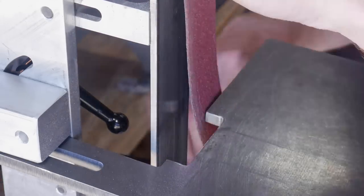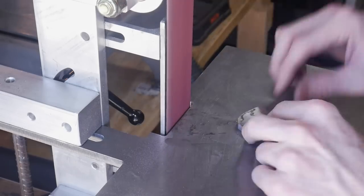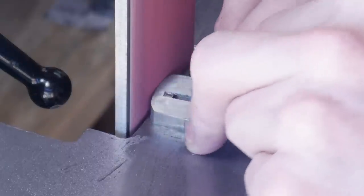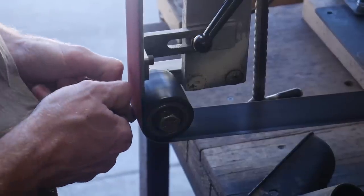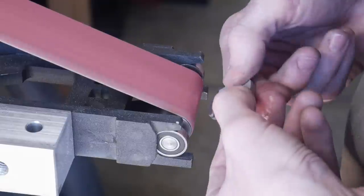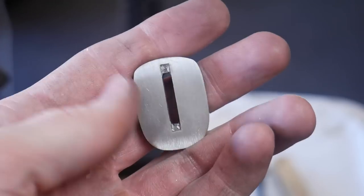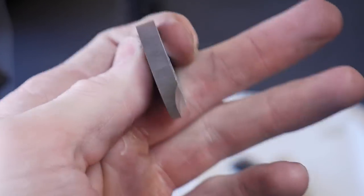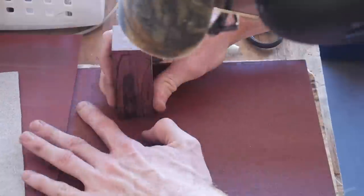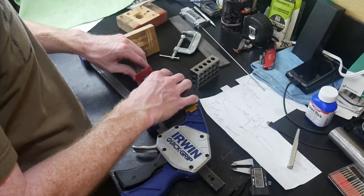We're squaring up the work rest so I can grind the guard to shape. I used a template to try to get both sides of the guard symmetrical — you can see my scribed lines there — but with the amount of grinding I ended up doing on the handle down the road, this part turned out to be unnecessary. Using the radius of the wheel, I started my curvature at the bottom of the guard in the finger choil — this is a one-inch wheel with a 60-grit ceramic belt.